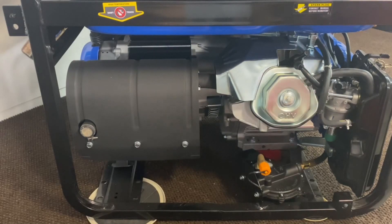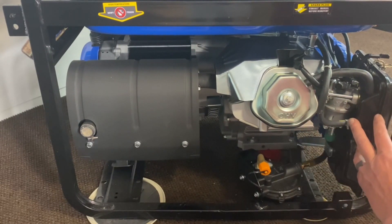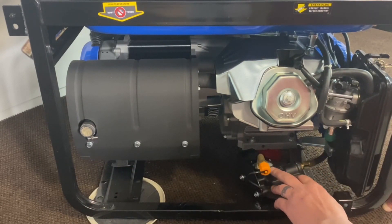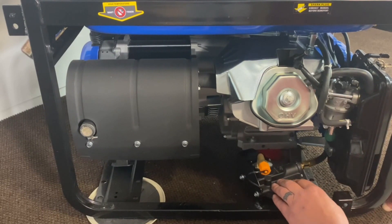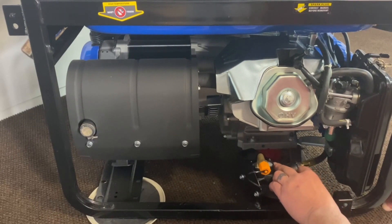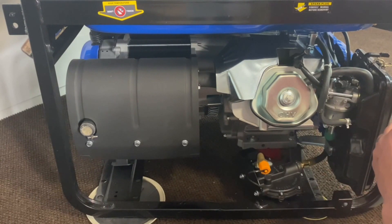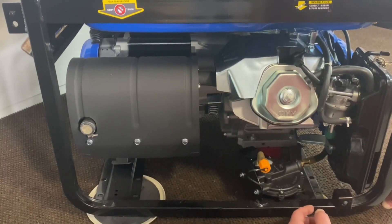In our first step, I want to show you this is their propane regulator. When you're running our natural gas system, we're going to put an adapter in here. You want to make sure that this is capped off so it doesn't suck vacuum on you. Now if this regulator ever fails, I've tried to search them out and I can't find them. So if this ever fails and you still want to run your propane, with our natural gas kit when we mount the regulator, if you buy our propane kit it will include the high pressure regulator that you can mount to a 20 pounder or up to a 100 pounder.